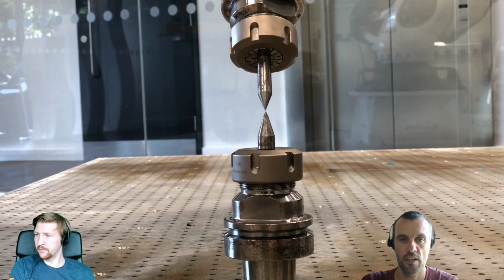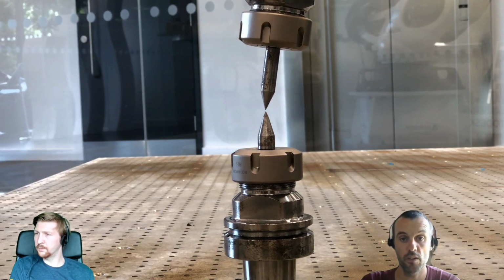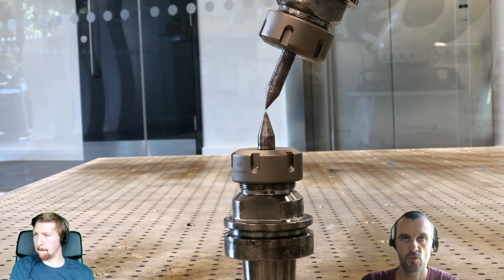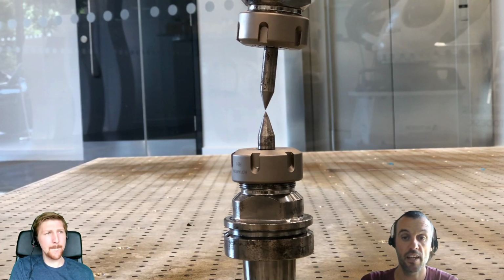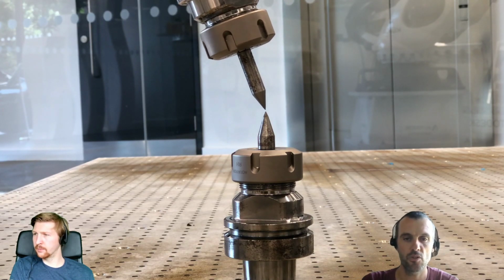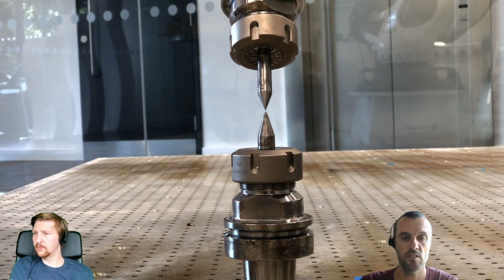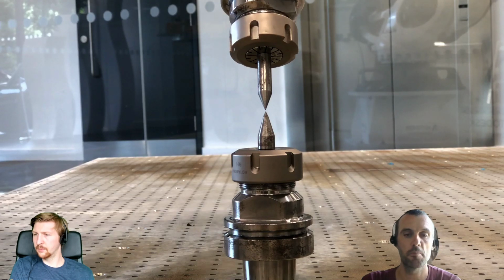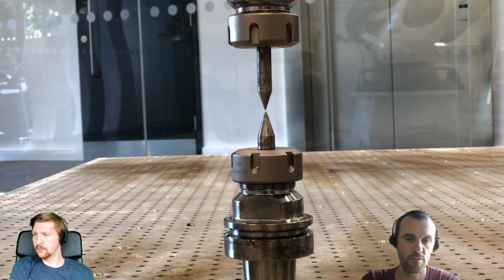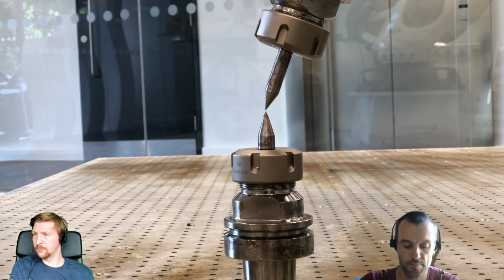What you can do is make sure that you select the tool that you want to drive or mill with. Make sure the controller knows what tool you selected, and you select the coordinate system of the tool, because there's a few coordinate systems in robots. So make sure it's the tool coordinate system, make sure the tool is the right number. Do this test and you know if it's correctly calibrated or not. So this is figuring out if the tool tip is correct. Most important for multi-axis jobs, not so much important for a 3-axis job.